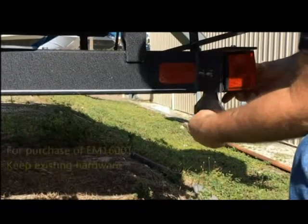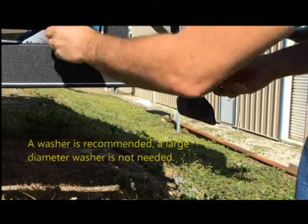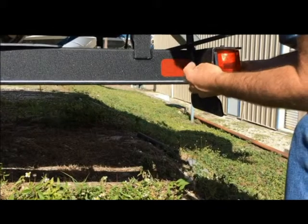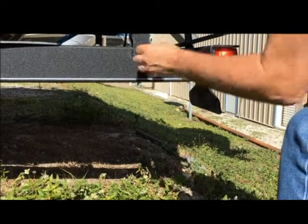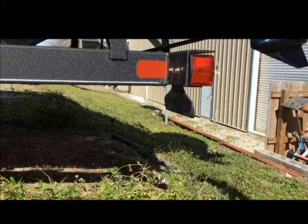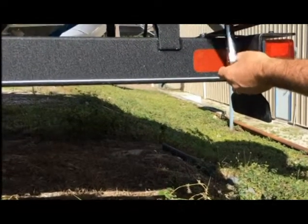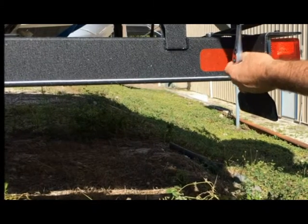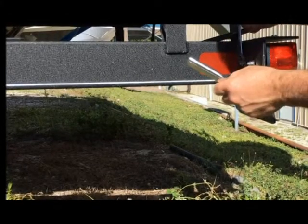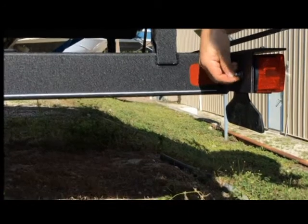Basically that's it. You have the flexibility of SurePlate and you can tighten up the fasteners. With this particular configuration having the washer is not as important, so you can use the original hardware. Just put that back on and do a pre-tighten. You don't want to go too tight because of the plastic cam on the inside — you can strip it. So go lightly. Preferred, use an open end wrench for better sensitivity. Don't over tighten it, then put a lock nut on to prevent it from backing out.